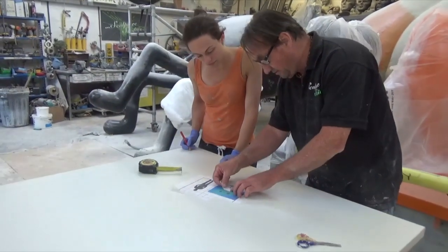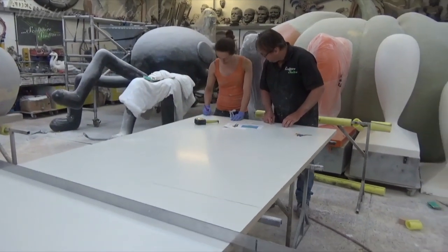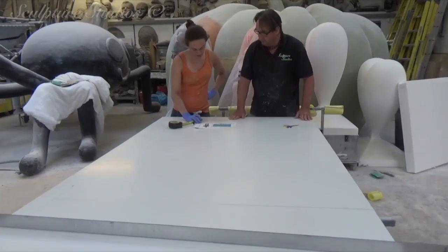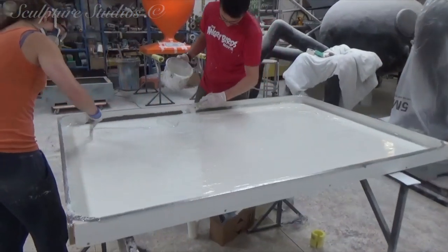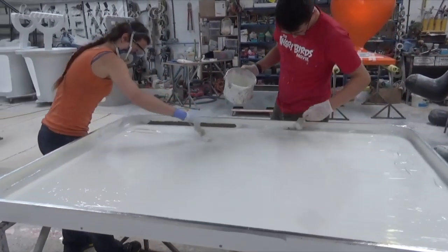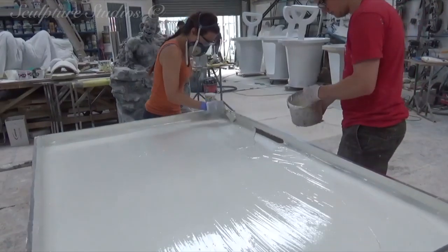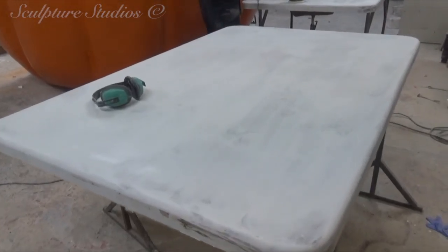Diving straight in, we're going to be creating effectively a master pattern and a mold simultaneously. In order to achieve the perfectly smooth credit card look that the client's after, we're using plastwood and building up walls around the edges. We need to make sure that this mold pattern is strong and accurate, as these patterns need to match up with the other half of the mold, and they're actually going to be made twice as we're creating two credit card characters. These are going to stand about 5 foot tall and the rest in pro rata, with the eyes, the eyebrows, the feet and the legs added separately.